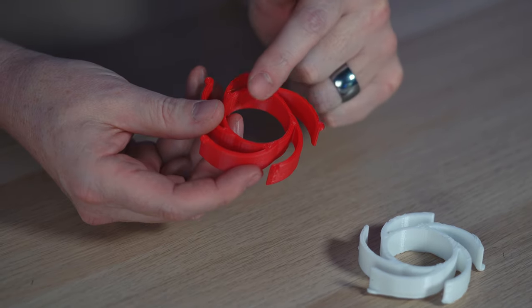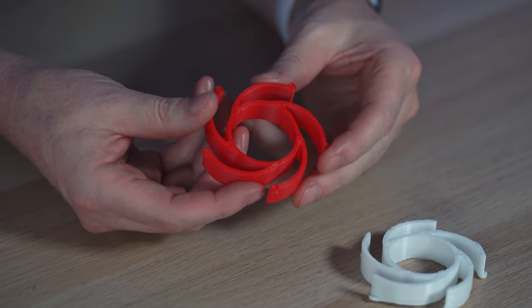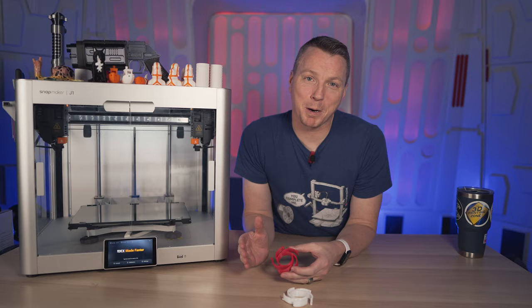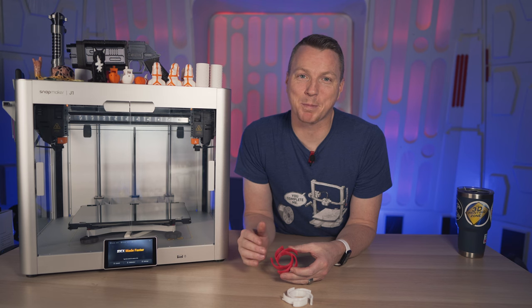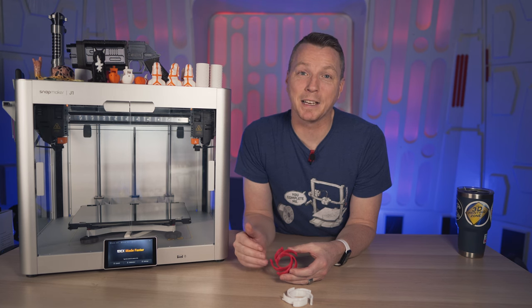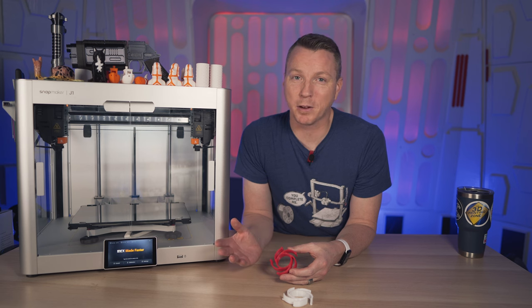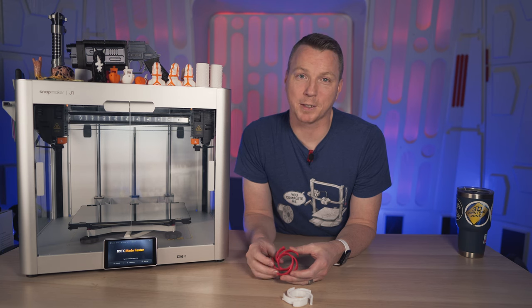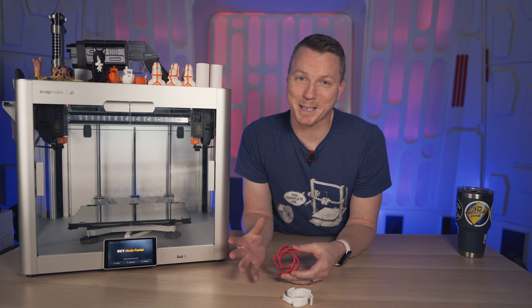I've got my little tabs on here, the details came out decent, it's not perfect. There's a little bit of issue on this bottom layer in particular, and I did that on purpose — I wanted to do even that initial layer at super high speed where I typically would do 20, 30 millimeters a second. I wanted to go 10X that and see what we could do on this first layer. And I'm pretty impressed with this.